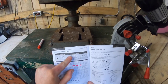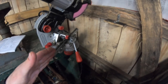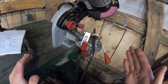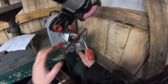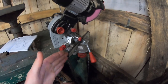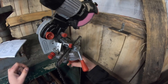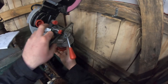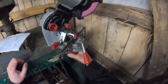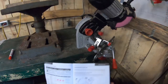Value B is the downward angle, which represents the angle of the chain relative to a level surface. The chain is tilted slightly. To set 10 degrees, I loosen this bottom knob, push it all the way back until it bottoms out, and snug it up. That is now 10 degrees tilted. You'll notice in this chart that no matter what chain type you have, it's either zero degrees or 10 degrees — no in-between.